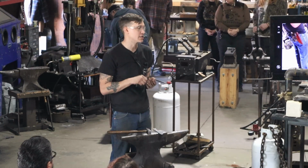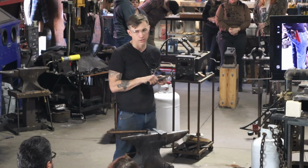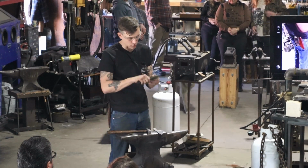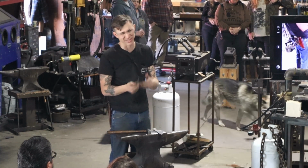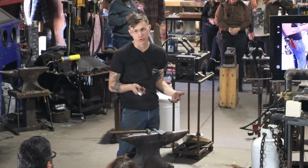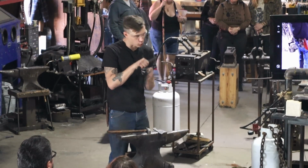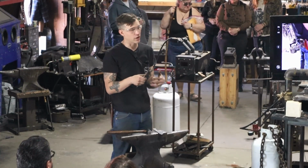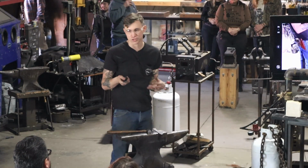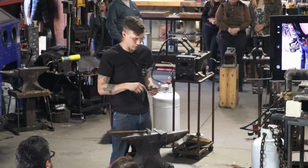That's another thing: if you can lock in with a lot of pressure on that, you're going to be able to get a lot of really good passes. Whereas if you're a little lighter and more tentative, you're actually going to struggle. Believe it or not, also real sharp abrasives are going to be easier. They give you a much more consistent pull that you can predict, whereas the well-used abrasives that are a little slicker, there tends to be a little slick jumping around on those.